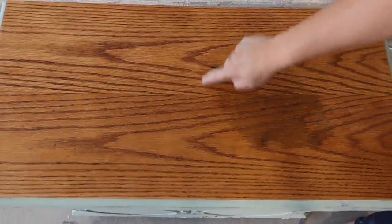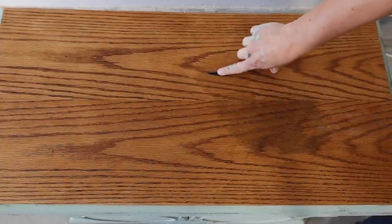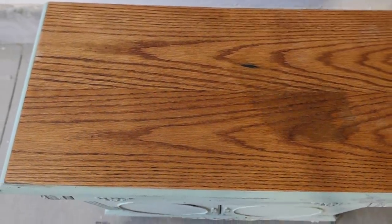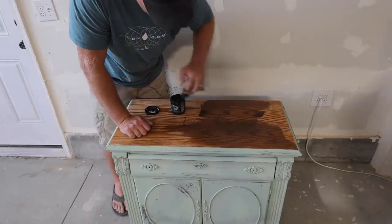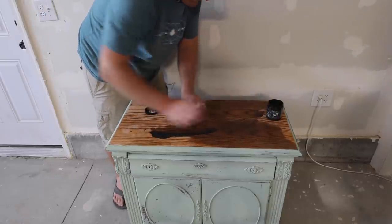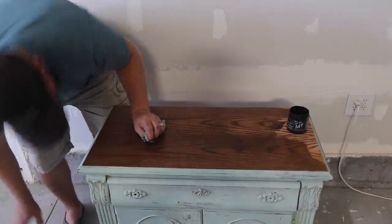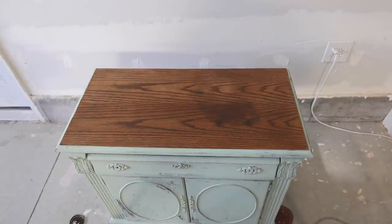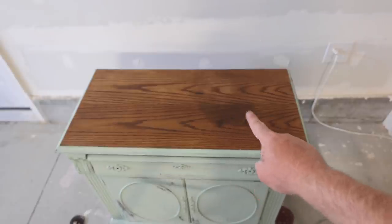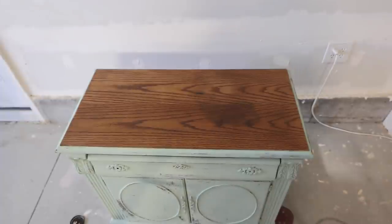We've got a stain that won't come out even after sanding, and ink that's permeated not just through the veneer but through the MDF — so that's never coming out. We also have a little bit on the edge where the MDF is showing. So we're going to use Dark and Decrepit, which is an all-natural water-based stain. It comes off your hands and brushes, it's not toxic, and it has a little built-in sealer. It's water-based, so you can layer it to hide imperfections while still showing wood grain. We've got one coat on and you can still see that stain, so we're going to feather in the Dark and Decrepit — a second coat should be real close to the same color.